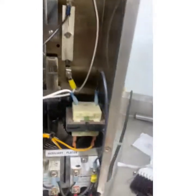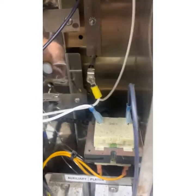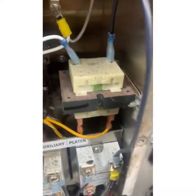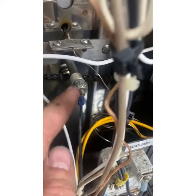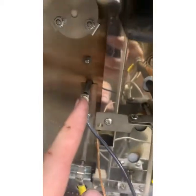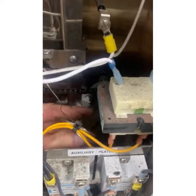When installing: zip-tie the cable ring so it's tight and can't move. When changing the high limit probe, note the depth it was pinched in. Watch out — if this little cap tube (there's five feet of it wrapped up) touches one of these lugs, it will arc out and break, causing a shutdown. Also stay clear of the chain spinning inside. Wrap and zip-tie it so you're clear of electrical contacts and moving chains.